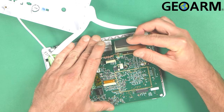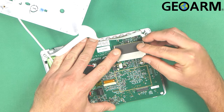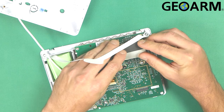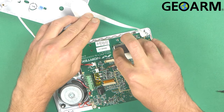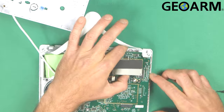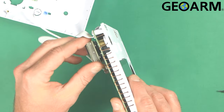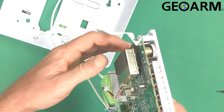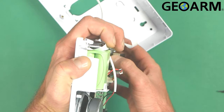To install the new module, you need to make sure that you get it lined up with all the pin connections and push it down for a solid connection. Once it's lined up on all of your pins and you're making sure that all of them are getting a connection, you simply push it down and seat it into its spot. Then check to make sure all the connections have been made properly — there are no pins being exposed here or on this side. So we are good to go.